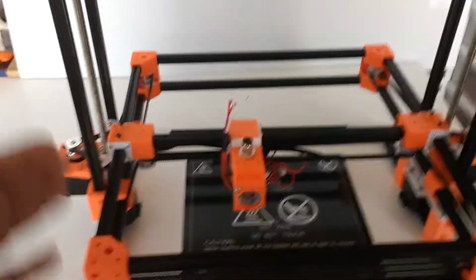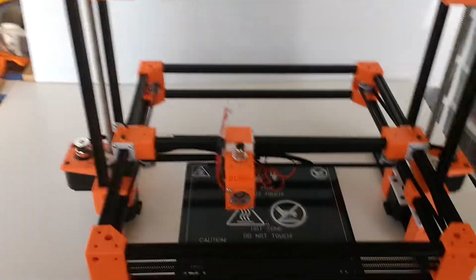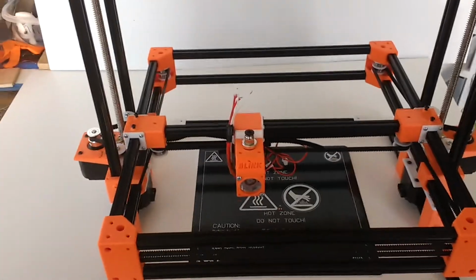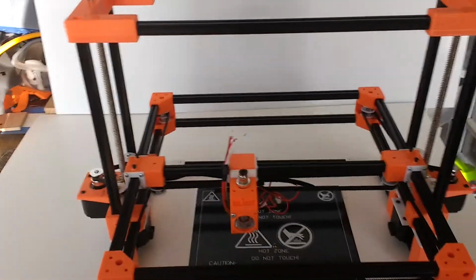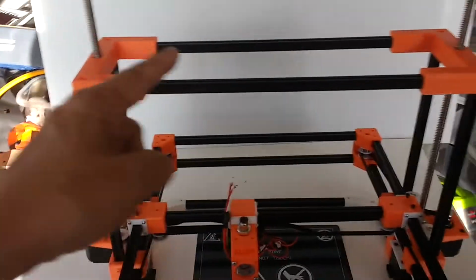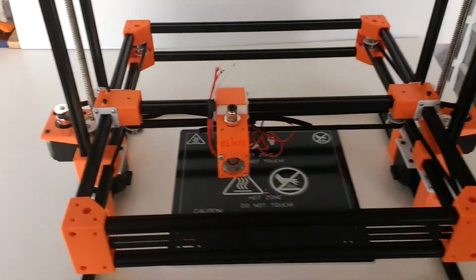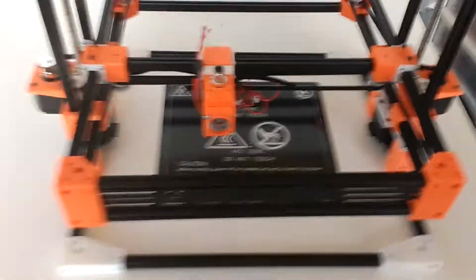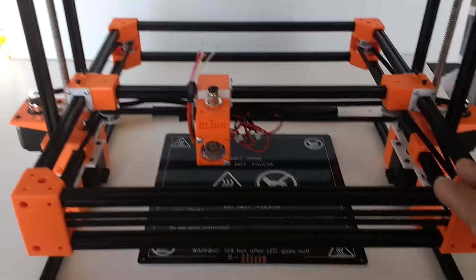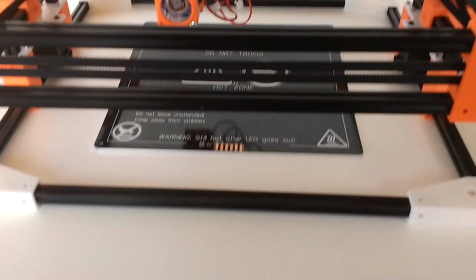I didn't want to have a cube for a box. I did an earlier design that follows that particular design mentality, and although it's just another Core XY, I wanted this to be totally different from that design, and so I ended up doing it this way, where these are my towers that allow the complete XY frame to rise instead of having this fixed at the top and having the table rise. And so in this setup right here, what you have is the complete Core XY assembly rising little by little. And I wanted to keep the table as steady as possible, fixed to the table.